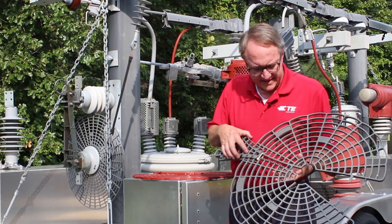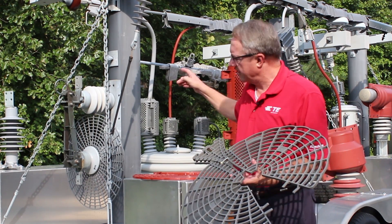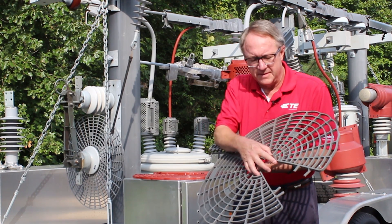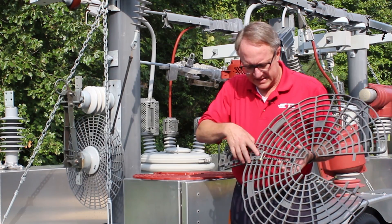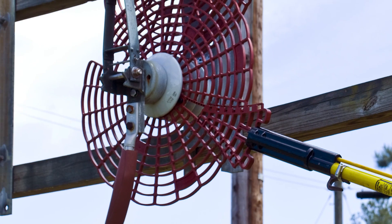It comes pre-assembled like this out of the box. The operators all they need to do is basically take the core diameter of what they see there, cut out the different parts here in order to match that core diameter, clip the little zip tie right there, and then take the hot stick and push it on to the assembly.